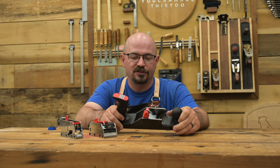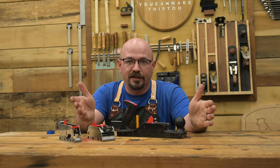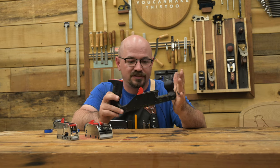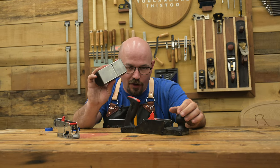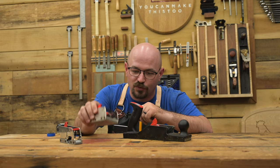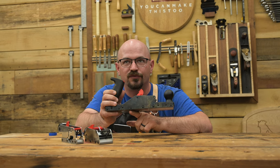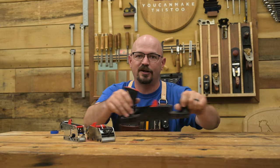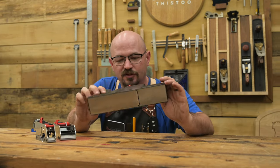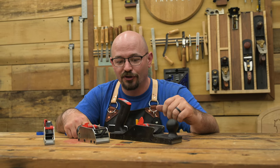If where you're really struggling is with your long edge grain glue-ups — making panels and struggling in the milling process to get edges close enough — that's where a longer plane like the 260 comes in for jointing. You can do that with a smaller plane, it's just more difficult. The nice thing about a longer plane is the larger surface area means it won't follow the imperfections of the board as much — it skates over them. A shorter plane can ride the hills and valleys. So if that's where you're struggling, start there. Once you have all three, you're going to be set.